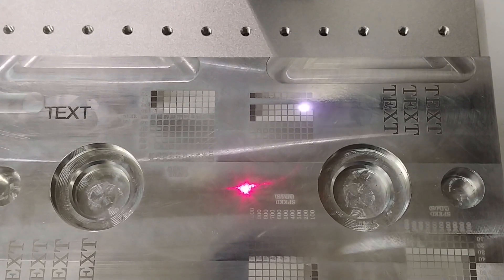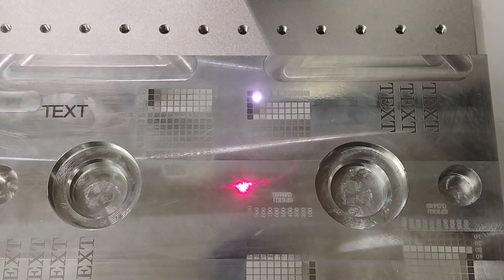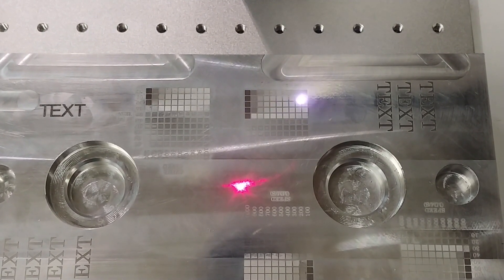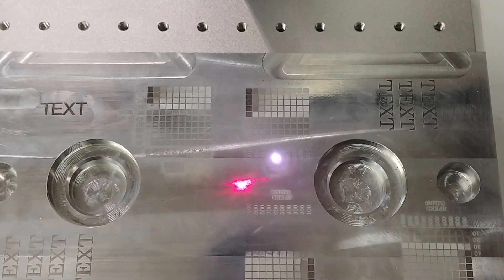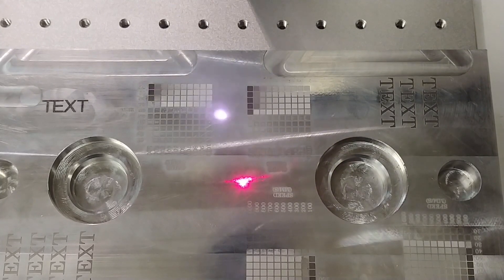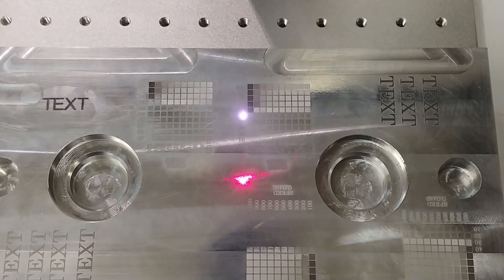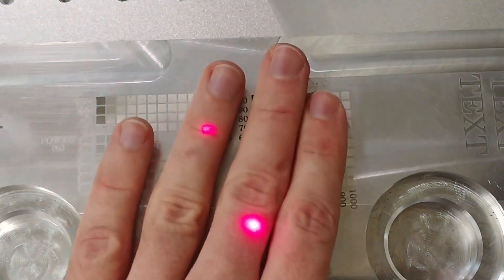I'll show a photo of the final result so you can see more clearly. I'll also show a piece of S7 tool steel later to see what the grid does to that material. One thing that's a little different about this mark: the power and speed labels being marked right now are done with a default pen set up for the top left text mark, so they'll show up a little darker than the other marks. Don't compare these speed and power labels to all the others — but the rest of the grid is a fair comparison.